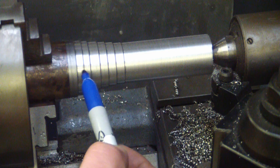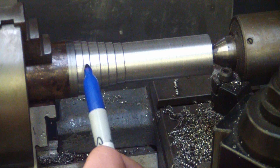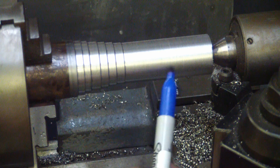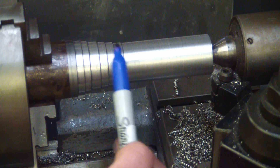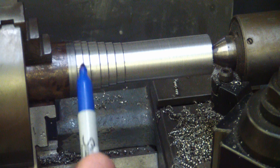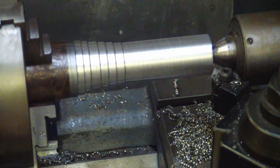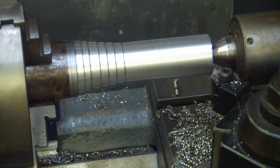I had been doing every quarter inch taking a 30 thou cut, but I can do every eighth inch and just take a 15 thou cut instead of coming back, because I've been taking 15 thou cuts anyway. So I could just step it down to one eighth inch and take a 15 thou cut. That way the steps are not as steppy and it'll be easier to make the nice taper.